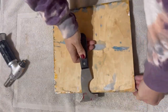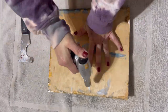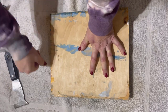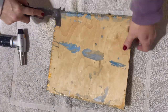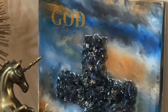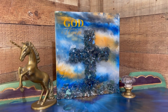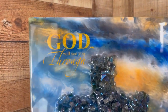Epoxy will drip over the sides, and you don't have to hesitate about those little drips. All I do is take that same crème brûlée torch I used to pop the bubbles, get it warm, and use a metal scraper to scrape them right off. Get them pretty warm — not so hot it boils, just warm enough that it melts and you can easily clean it off. Then it'll be ready for you to paint the back. Here it is, absolutely stunning — I posed it with my little brass unicorn. No matter what, God will see you through.